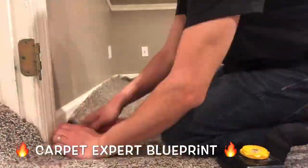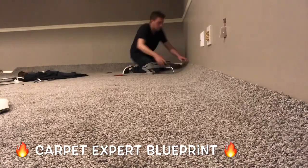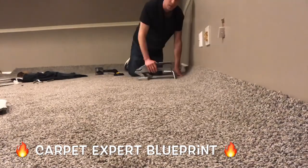It's super common for your carpet to hit the humidity in the summertime when you install in the wintertime — everything buckles on you. It's all bad. So get that good stretch going. Make sure it's acclimated to about 70 degrees in the house and you're good to go.